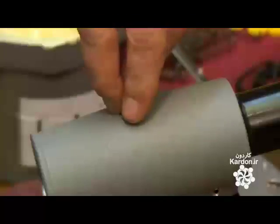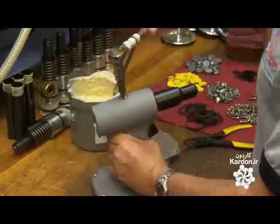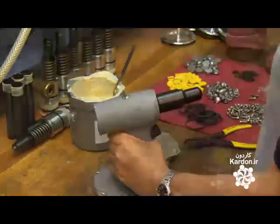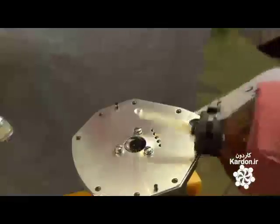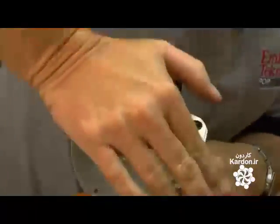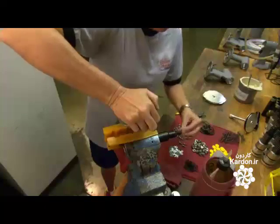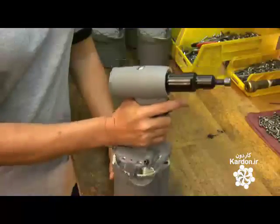She installs a fill screw in the top of the handle casting for top-offs of hydraulic fluid during servicing. But the initial supply of hydraulic fluid is added through the steel sleeve at the bottom. She inserts an air piston assembly into the fluid-filled chamber. She threads a screw into the nose of the rivet tool. This keeps the internal workings in the correct position for the next step.